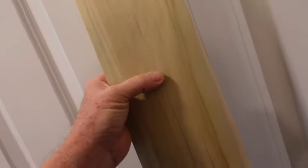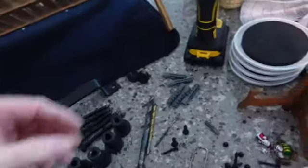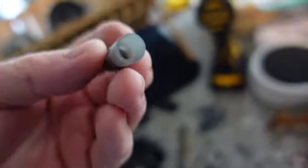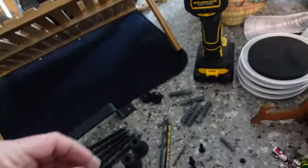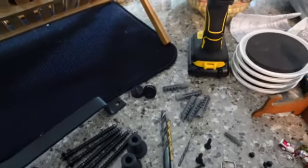So the only place I hit wood was on this one here, and then I had to do the drywall screw things there. And so let's hang this up, and I'll hammer through these five holes to see what's back there. And I'll mark those on the wall, and then we'll worry about if we use these or not. I hope not. I might recommend that a person go get something a little bit more substantial. Those big anchor bolts, if you can get it to fit in there.